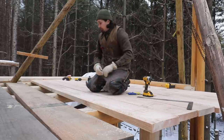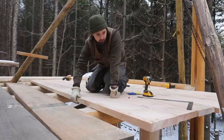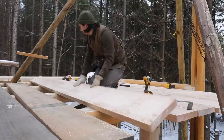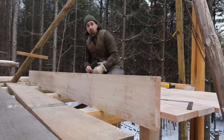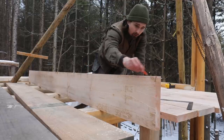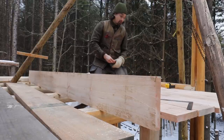Since these are just rough-sawn boards, they've got some warp and some twist and some bend. So each board I'm planing down a little bit, marking so that I get as minimal a seam as possible between each board. I'll mark the high sides and plane it down.